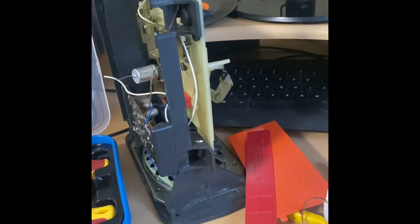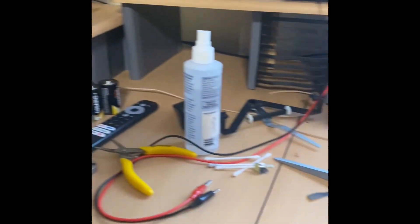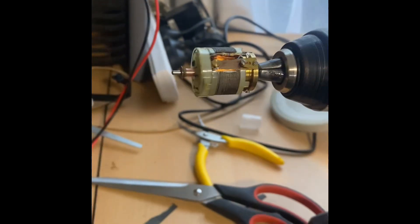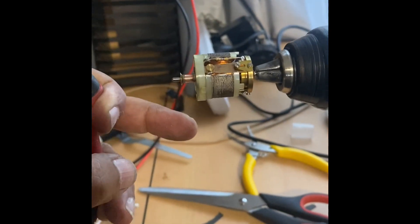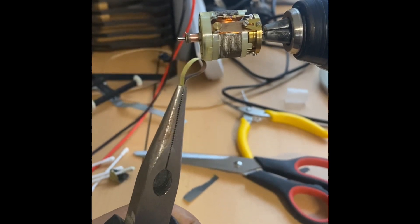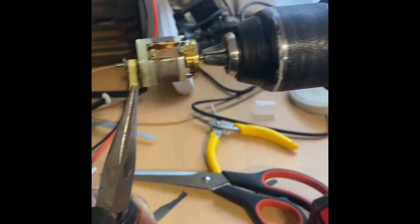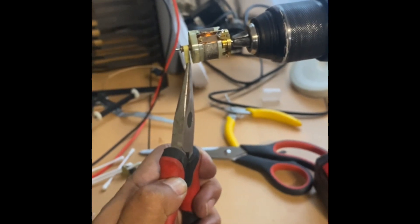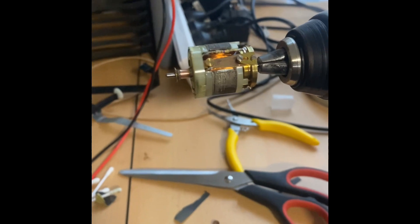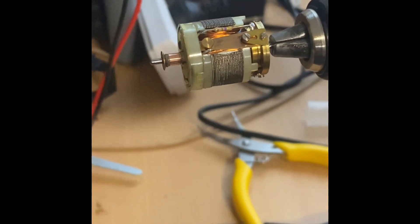Grundig fans, I have a beautiful portable record player here. It plays 45s and it's in really good condition - it is totally orange. The problem is the motor is not starting. So I've taken the motor apart and found the commutator had terribly deep grooves. What I did was make a thin strip of 400-grit sandpaper and hold it against the commutator while spinning it in the drill at max speed. That seems to have polished it up really nicely - all the grooves are gone. If it works, this is a good trick to fix other motors in electronic gear.